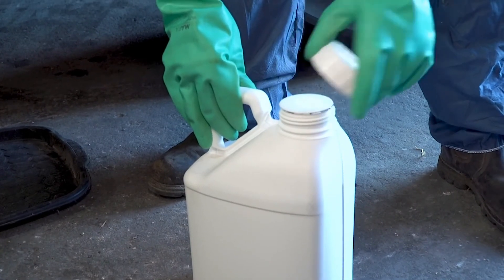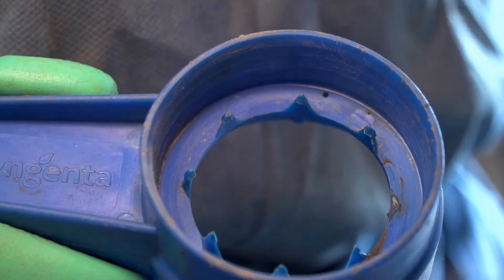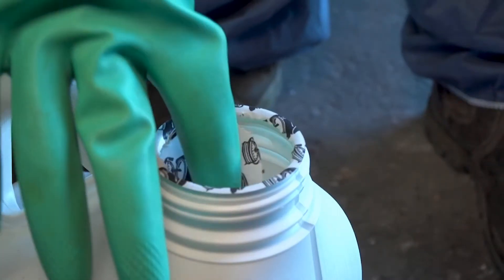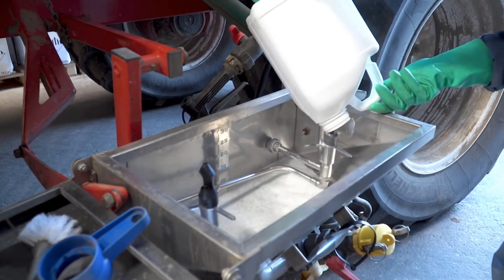Sometimes when you take the lid off, the glue on the cardboard inside the lid has stuck the cardboard insert to the top of the foil — so that's another thing you have to deal with before opening the foil. The best way I've found is I've got a can spanner from which I've removed a tooth: you only turn it about five degrees and it tears the foil, but because the tooth is removed it doesn't take the foil off completely. I can then pinch it, lift it out without contaminating my hands, and as the product comes out it rinses the foil. When I put it on the can washer, the rinse water cleans the foil. I can then move the foil — because it's clean — into a double bag which gets taken away by a licensed waste contractor.